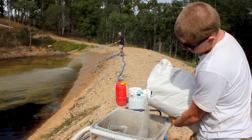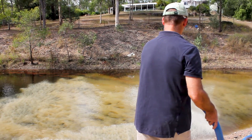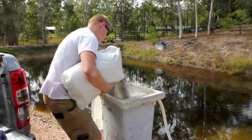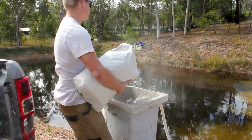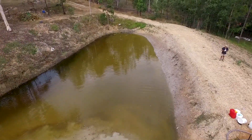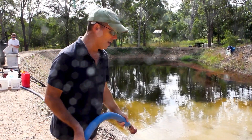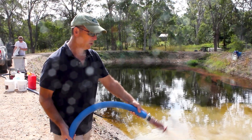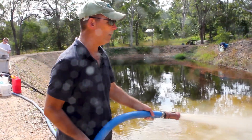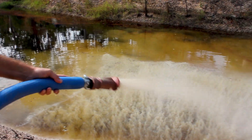What we're doing now is putting a bentonite slurry over the top of the dam where we've applied the polymer, and we're using our fire hose to do that. We've basically got a trash can over there and we're recycling the water through to keep it in a slurry — it's a bit easier using this method to apply bentonite rather than the powdered version. What this is also doing is helping our polymer activate. You can see the mess we're making — that will flock out over time. It's giving the dam polymer some clay to attach to, and we're also able to spray it over the bank. There would have been some polymer that landed over the bank, and as the water level comes up we want to anchor that in place — this slurry will help do that. By pumping it over, it'll all turn white, but slowly it will settle out and give a layer of clay and silt across the bottom of the dam without us having to dump dusty bags of bentonite.